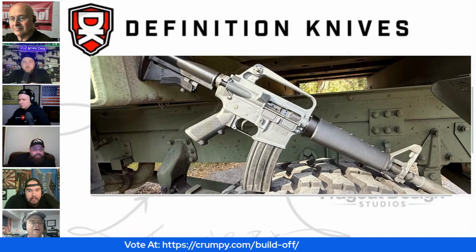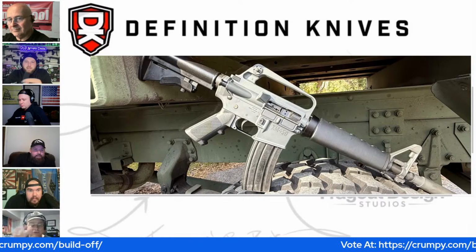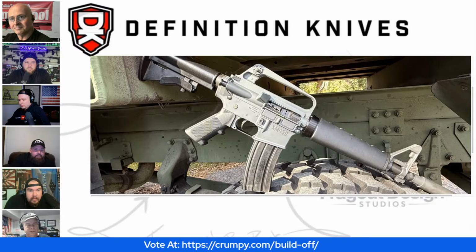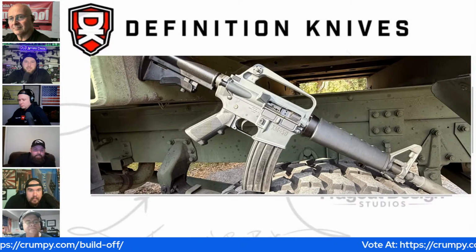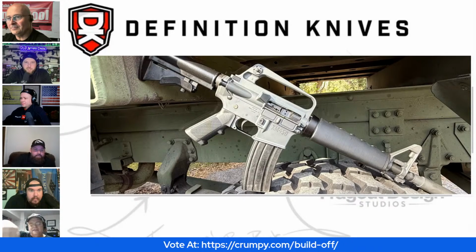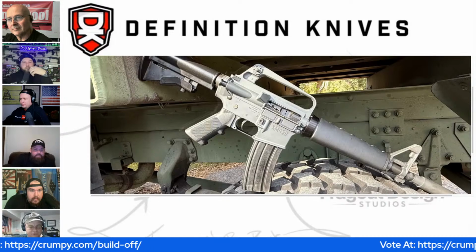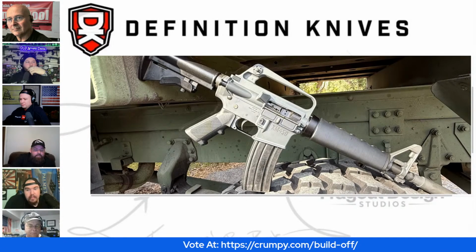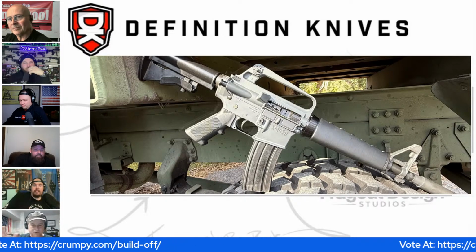Now I know a lot of people are going to be like, "Well, duh, he has machines and lathes, mills, and all that." But that was all manual. There were no special drawings. I just said this is what it should look like, looked at other pictures, and started cutting it. Dude, if that is not a testament to Safety Harbor Firearms, that he freehands an XM177 brake for a 450 Bushmaster, kudos to you, my man. The slots on the end of it were done on the milling machine. Chris did that because that's the easy way to do it. But the brake itself, I basically just measured this, did that. That looks good. Boom, looks proportional.